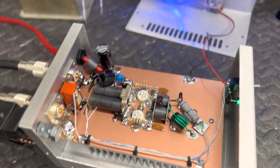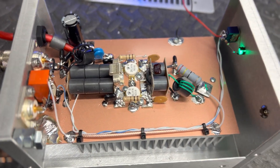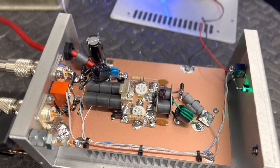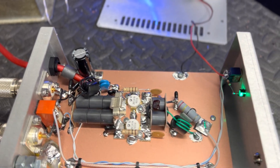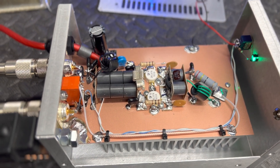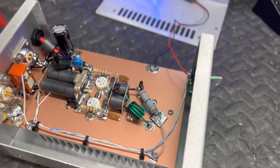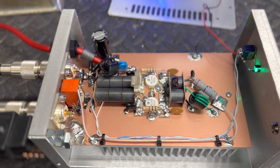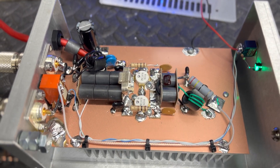You don't take 100-watt transistors and get 400 watts apiece out of them. You don't take 150-watt transistors and get 400 watts apiece out of them - they just don't have it. If you see that, just take the wattage divided by the transistors. If you're seeing 300-400 watts per transistor, there's something going on. These transistors right here are 100 watts each, the C's are 150 each, and they won't do that much. I've seen some wattage claims lately and it's kind of disappointing. You guys can believe what you want to believe - I'll try to educate you to the best of my knowledge. You can't beat Ohm's Law.